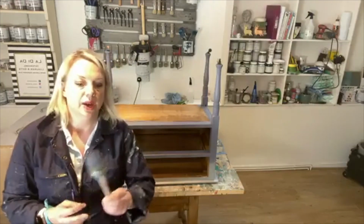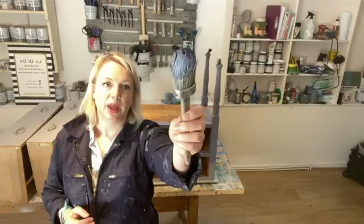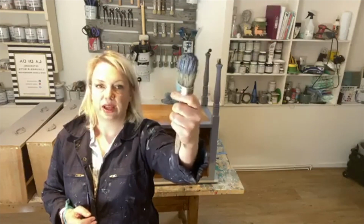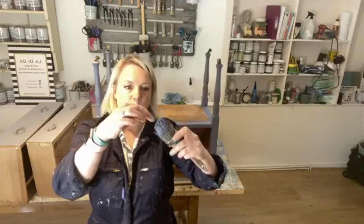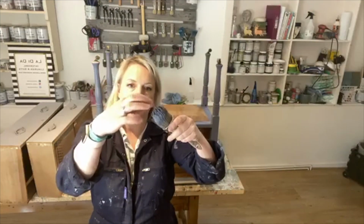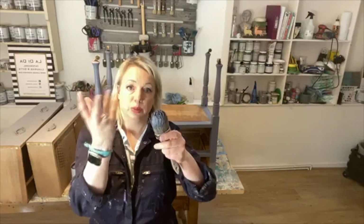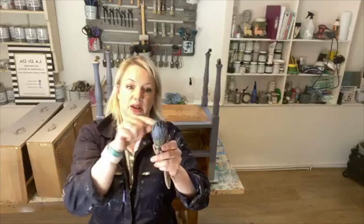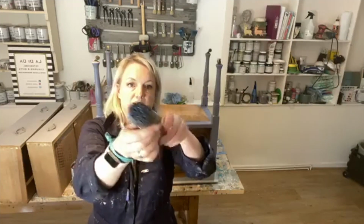Yes, of course. So the paintbrush I'm using is a Sloan bristle brush. And these are a brilliant bit of kit. They have bristles all the way through. Sometimes when paintbrushes get wet, you can get a hole in the middle where the bristles part. That's because they've got a filler in the middle and the bristles don't go all the way through. These don't do that because the bristles literally go all the way through, and they're hog's hair, so it's split-ended.